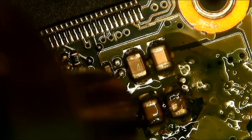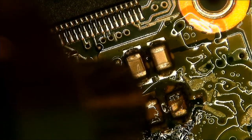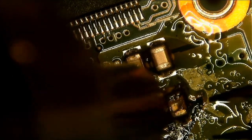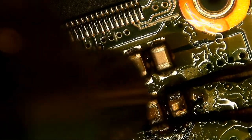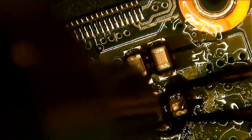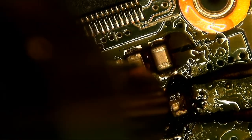If I didn't know which capacitor was damaged, what you do is use alcohol and inject 3.3V — or whichever voltage matches the shorted power rail — using a DC power supply, then search for which component gets hot.